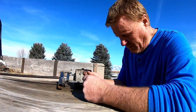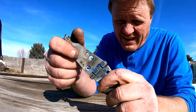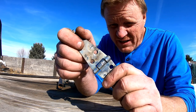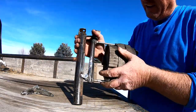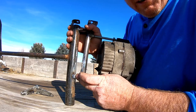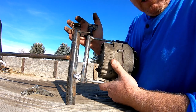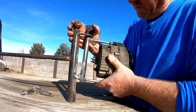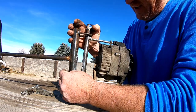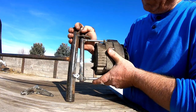I started using that stupid hinge — I'll show it to you. This is exactly why a regular hinge won't work. As soon as it got a little hot from welding, that little nylon bushing just melted and caused all kinds of slop. So what I did instead: we used three nuts and a bolt, and that keeps the slop down to a minimum. Because this thing is going to be torqued left, right, up and down from the wind — and these things get pretty wild when it starts blowing, trust me.